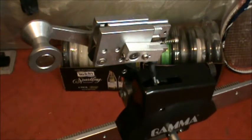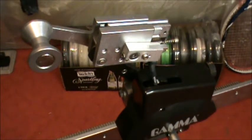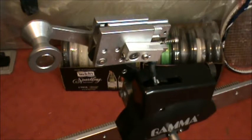And when we finally have the tension on the calibrator, let's say 30 pounds, when this is set to 30 pounds and the calibrator is reading 30 pounds, we don't want to adjust that any further. That's when we will tighten this set screw to hold that in place. And then we'll be checking 40 pounds, 50 pounds, 60 pounds, and so on. You don't even have to check 30 pounds really, unless you're stringing badminton rackets, squash rackets, racquetball rackets. If you're down in that low tension, or you're stringing your tennis rackets really low, you might just skip over the 30 pounds and just check it at say 40, 50, and 60 and call it done.